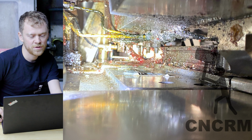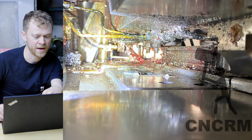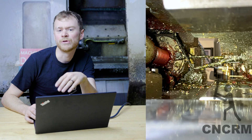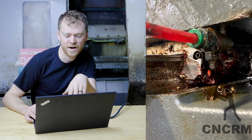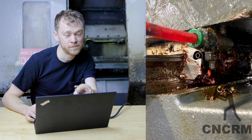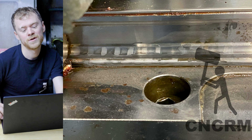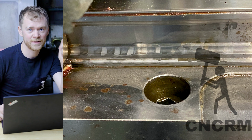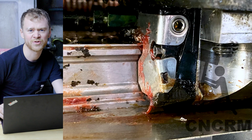Here's underneath the X-axis wedge on the Y-axis rail. Just looking down there, it was gross. Here's another one. Lube lines are trashed. Things don't look nice. There is a rail for Y. Well, truck. There is the rail. Things got hit hard. So getting rails and ball screws for Y as well as for X as well as for B. Here's another picture of a smashed rail.